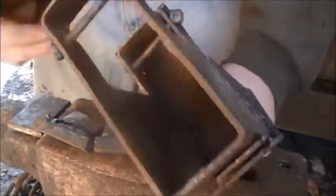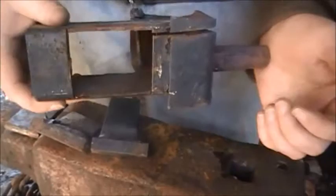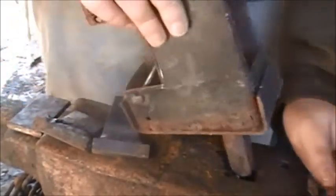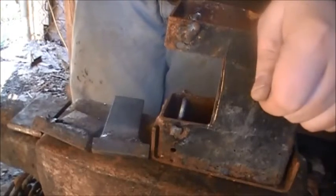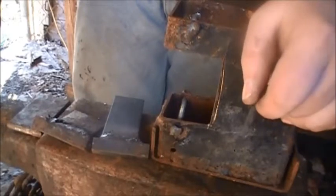That way, if I'm feeding it in this way, I can have room to stick out, so I'm not just stuck going back and forth. I have as much of the tool I can use as I need. For my hardy shank, I just welded it on, but you don't really need to do any welding for this project. That's why this version is great for people who don't have welders or minimal tools — really all you need is a hacksaw or an angle grinder and a drill.